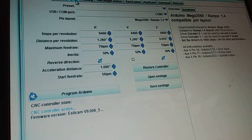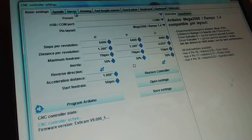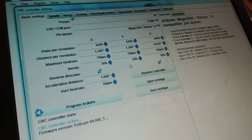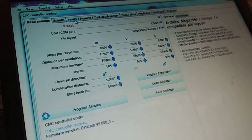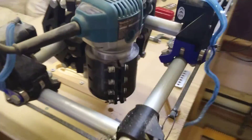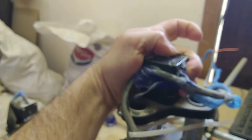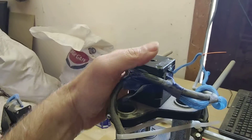I'll try again. It's a little aggravating, but once you get it set right it might be slow but it won't lose steps. Before you change the voltage on the driver, you want to check the motor — feel it and make sure it's not very hot. If it's already hot, you don't want to be bringing the voltage up.